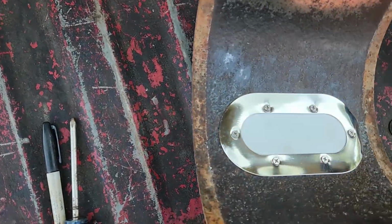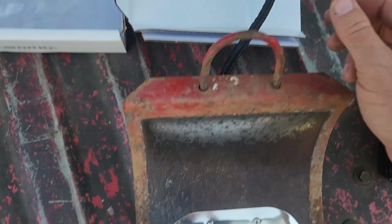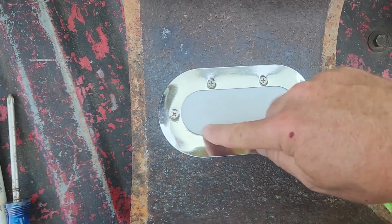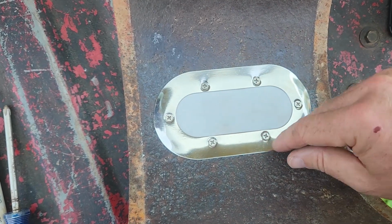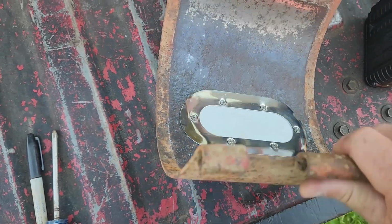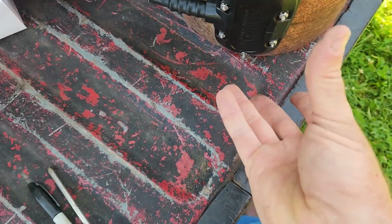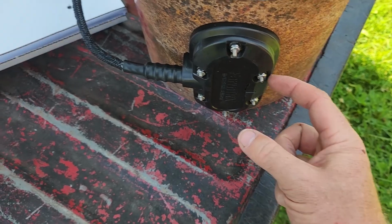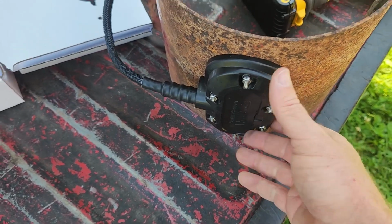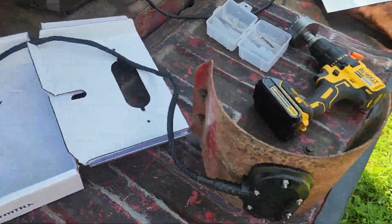The base of the sensor kind of sticks through in order to leave the wiring on the outside. You install these screws, which all they do is attach to this metal plate, the flange on there, and then the back side of the screw sticks through even further, and then you're able to slide on this plastic cover from the outside, and then you got nuts and washers to hold this on. So the rest of the wiring is already in place from when we did the moisture meter.